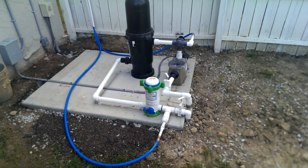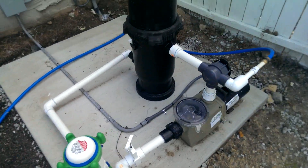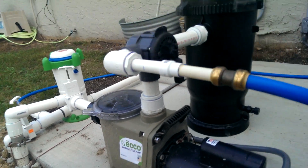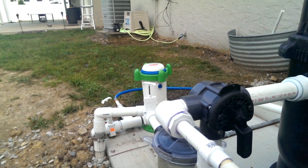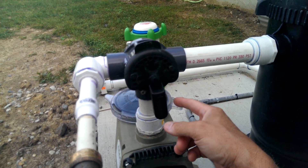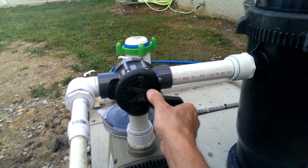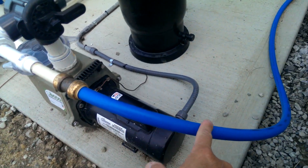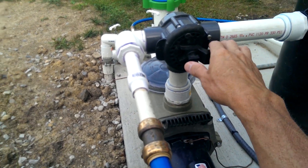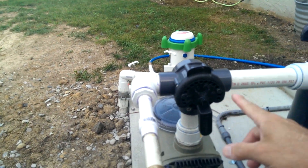For our pump, it's kind of my first generic setup until I get it better next year. We have a diverter valve — you go from the pump, before the filter, and put in a diverter valve. Right now we want hot water to go to the roof and into the pool. Nighttime or when it's cooler, that's off, so there's no water going to the roof. When it's a nice hot day, say in the afternoon, we turn it on — it splits and shoots half the water up to the roof; the other half still goes through the filter.